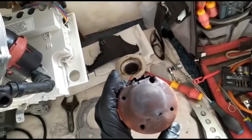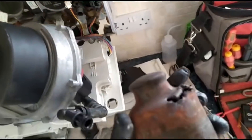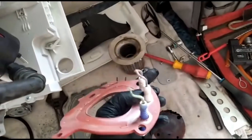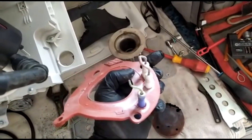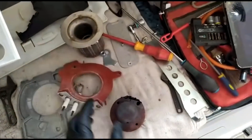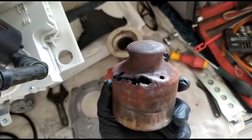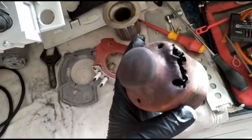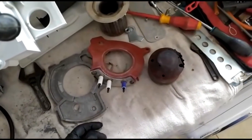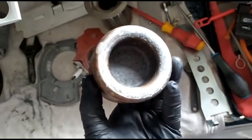The readings weren't that bad, but I hadn't checked the burner seal. When I did my analyzer readings around the edge, the readings were good — it wasn't passing. Obviously it hasn't gone all the way through, but it's brittle. Just goes to show: readings only slightly out, and yet the top baffle is completely burnt through. Another reason not to always trust your analyzer readings alone.